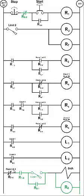Now, when the cylinder is home, this is closed. We know that. And because this is a spring return solenoid valve, the cylinder is at home, because if we don't energize the solenoid in that valve, then the valve is not going to tell the cylinder to move. So we can assume that if the solenoid is not energized, the cylinder is at home. If the cylinder is at home, then this is closed. So now this becomes energized. As soon as that energizes, the cylinder starts to leave, and then this becomes open.